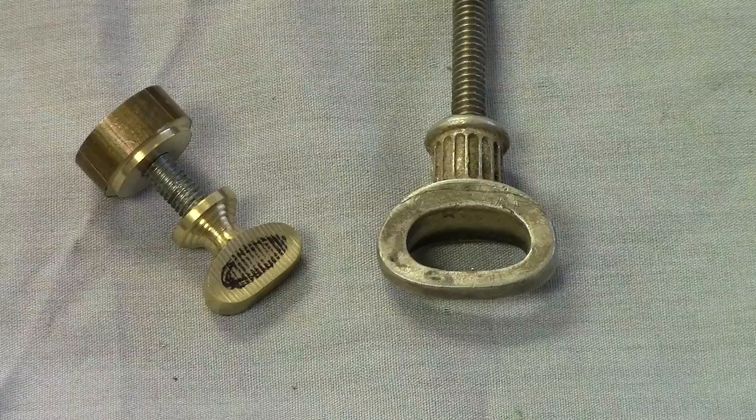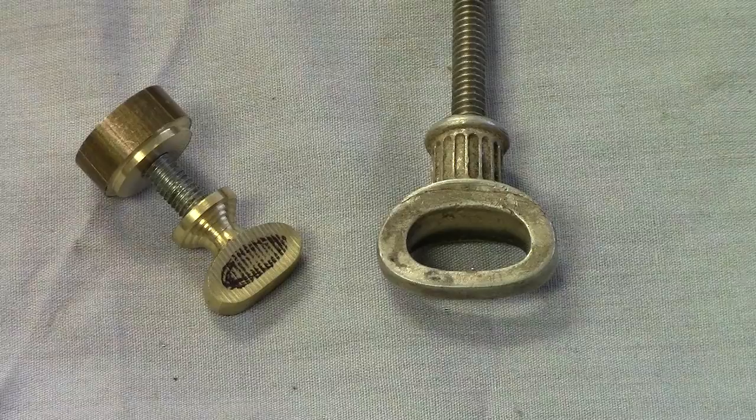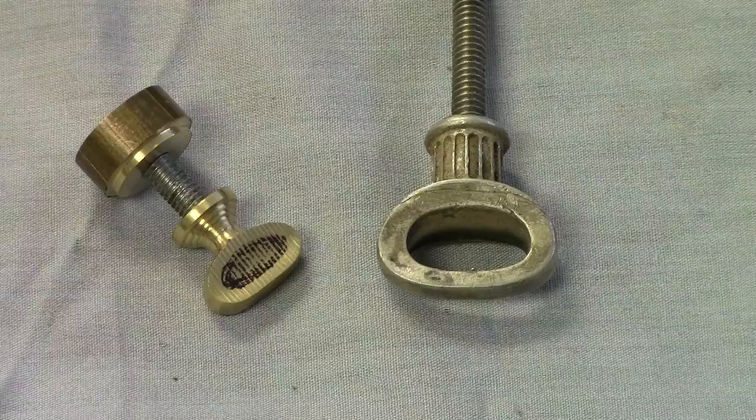But you see on the one that we've made today, I'm using a black magic marker. I've roughly drawn in the profile and the hole opening I want. Pretty basic operation here. You've got different choices. You can drill it and rough it out with a jeweler's saw, or you can mill it undersized